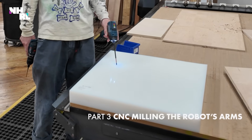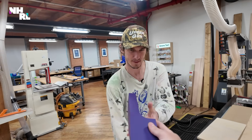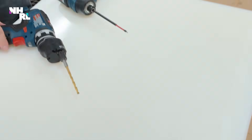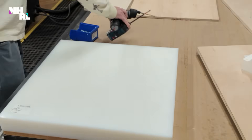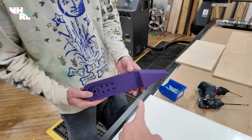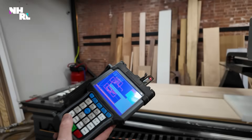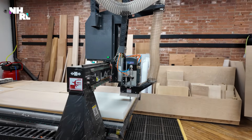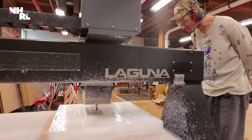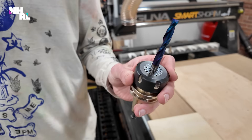I have like eight arms in here and I've got to get them out. The arms are like this - this is UHMW, an industry-standard fighting robot material. So I have my tool paths, all nested in here. The tool paths are inside the computer and I post them onto a flash disk, which gives me the G-code. The G-code is going to cut using a big long tool with two cutting edges.